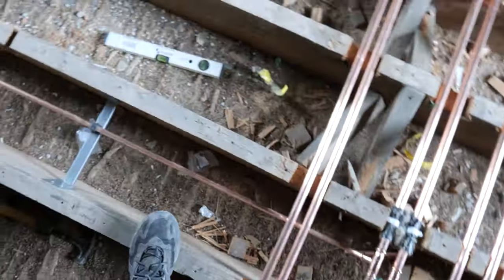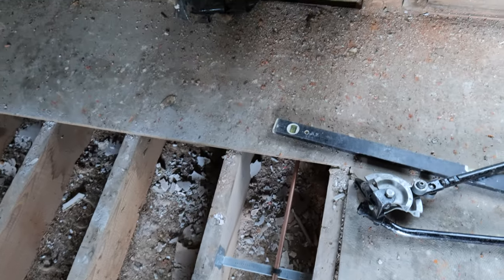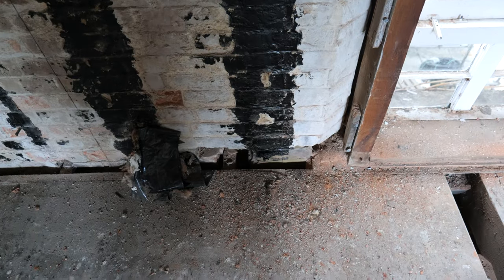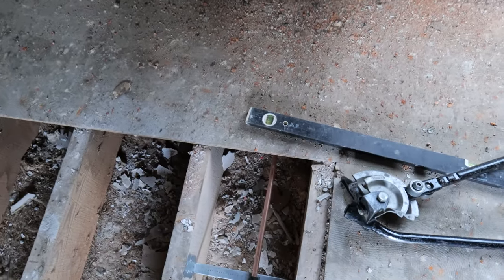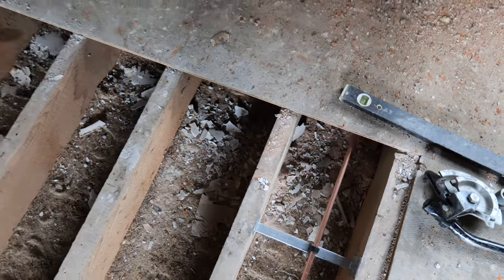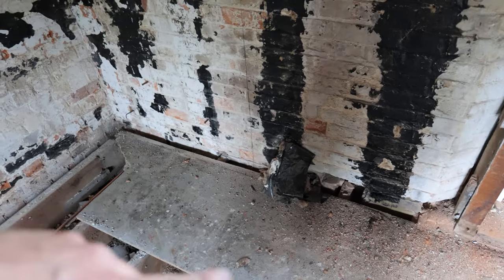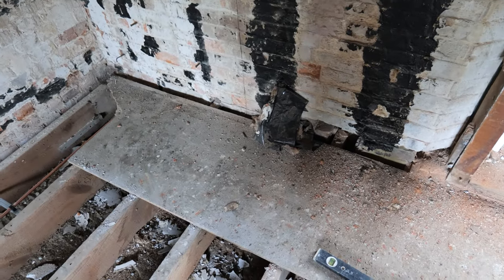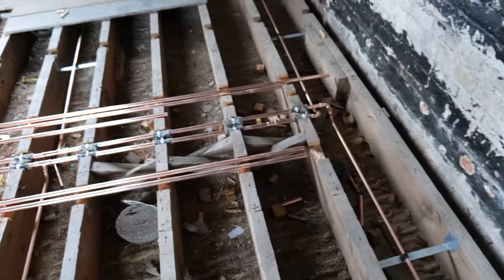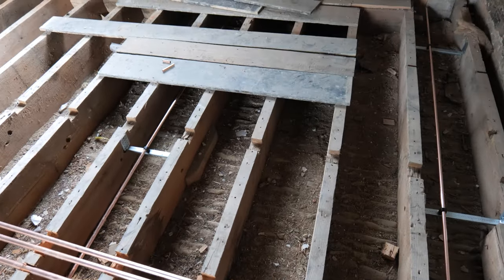At this stage we're not actually bringing the tails through the floor — we're just leaving the pipes underneath the floor ready to go. The reason is we're not sure what the depth of the wall is going to be once it's insulated or boarded. The pipes are underneath at the right center. What I'll ask the builders to do is, if they're laying chipboard flooring, to leave hatches underneath each radiator so we can bring the tails up exactly right. There's not really much point in guessing and bringing the tails up now — no doubt they'd be wrong and it'd be a complete waste of time.